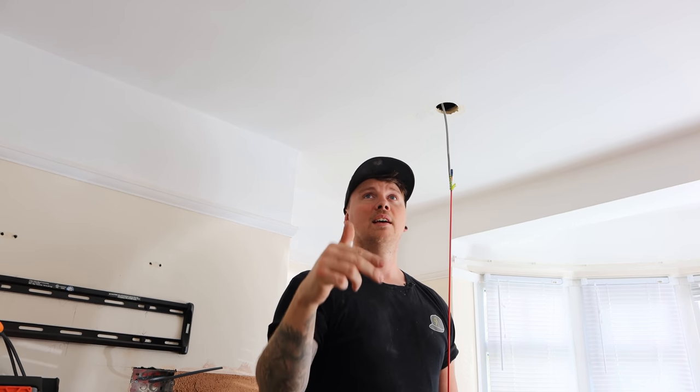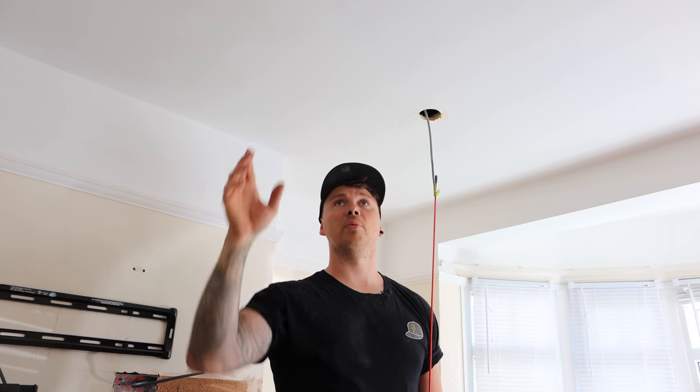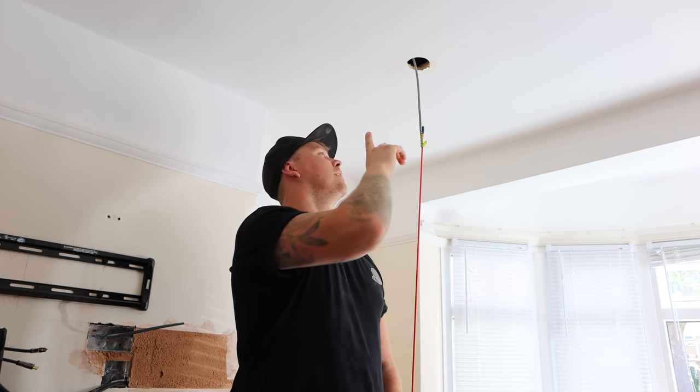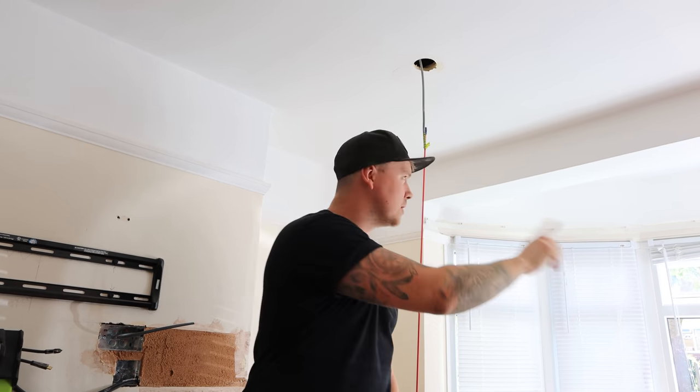Just behind Kip, hanging out the ceiling, is the downlight feed in. So what we'll be doing is a maintenance-free joint above the very first light in each room. But we'll also write that on the certificate as well in case anyone ever wants to find it. It should be quite easy. Yeah, and then from this, I've done the two holes in the bay. They'll be just linked together.